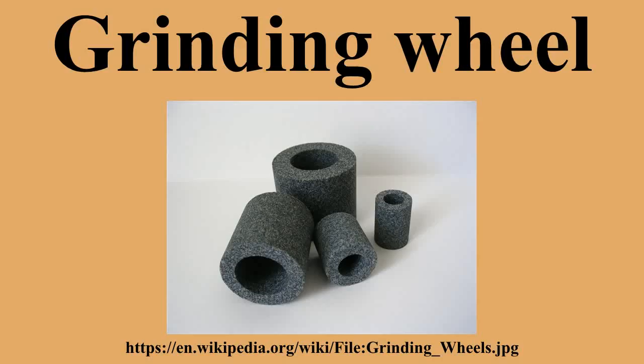A grinding wheel is a wheel composed of an abrasive compound and used for various grinding and abrasive machining operations. Such wheels are used in grinding machines. The wheels are generally made from a composite material consisting of coarse-particle aggregate pressed and bonded together by a cementing matrix to form a solid, circular shape. Various profiles and cross-sections are available depending on the intended usage for the wheel. They may also be made from a solid steel or aluminium disc with particles bonded to the surface.